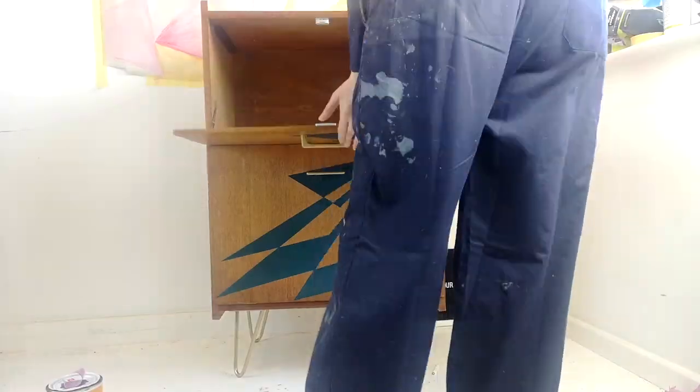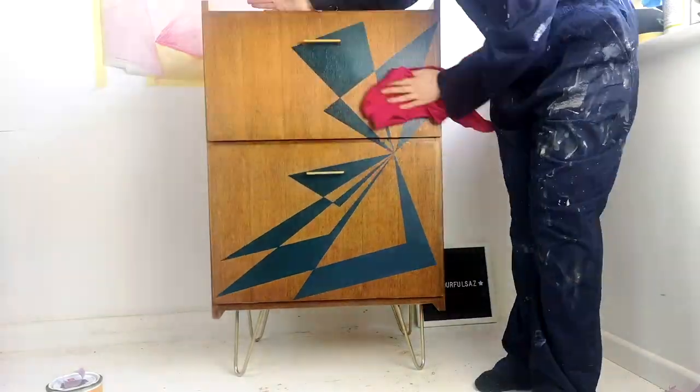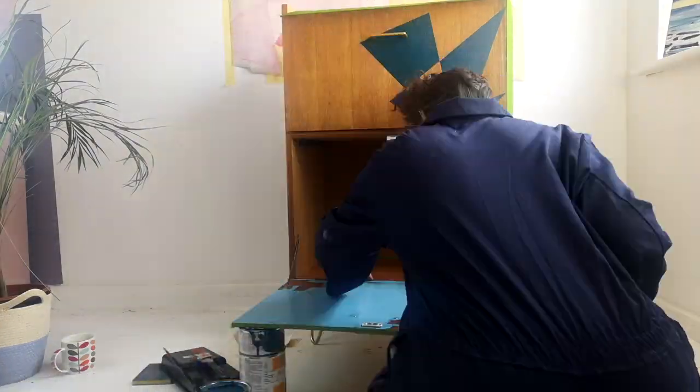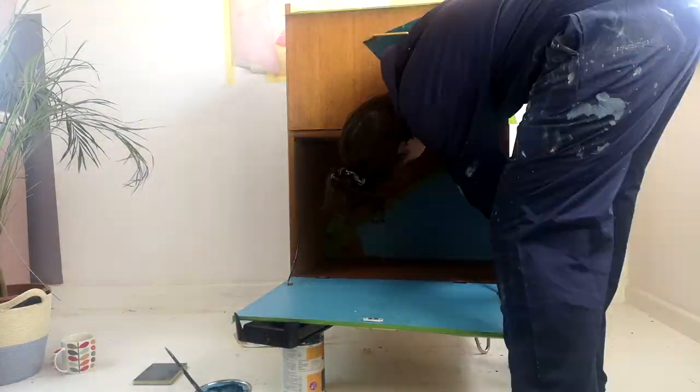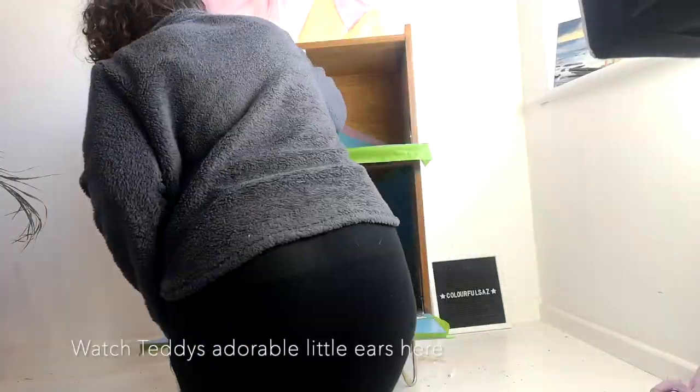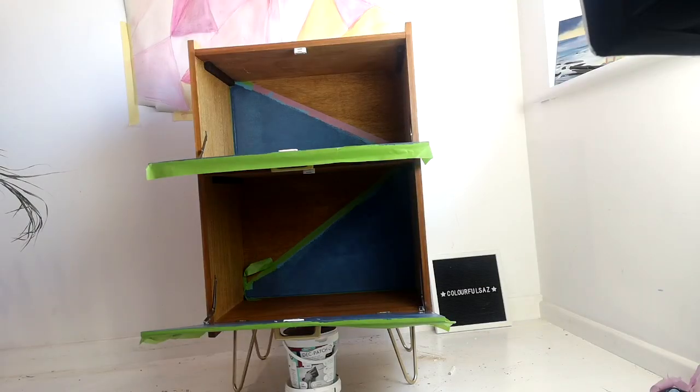Next I use teak oil to bring the wood back to life — I just wiped it with a rag to make sure there's no dust and then put oil all over. This is a self-sealing paint so you won't have any issues if you use a self-sealing paint and then use oil. Then I'm painting the inside — painting the two doors with a triangle on each back. That's primer going on there, a light blue primer, then I'll go back in with the same dark blue I used earlier.